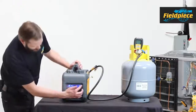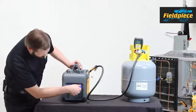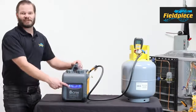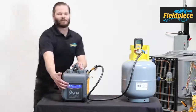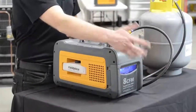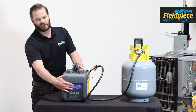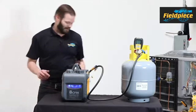You'll also notice right here I have a huge sight glass — and this is more than a sight glass, it's like a big window. We backlit it so you can easily see how dirty and how full of moisture your vacuum pump oil is. Both the 8 CFM and 5 CFM have this feature so you easily know when you have to change the oil.